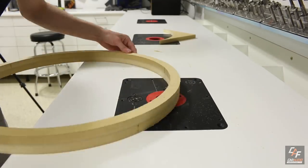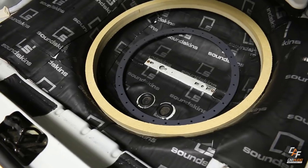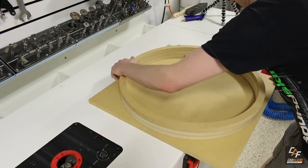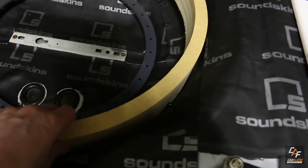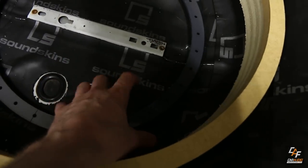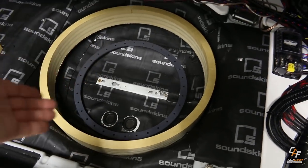After drilling a pilot hole to start the router bit I cut out the inside of the shape and then the outside. This gives an idea of what I've started to do in the trunk with the large circle — I definitely need to add a couple more layers. To add more layers I repeat the same process. I've now got four layers built of the overall circle size. Next I want to make the bottom layer that will space over and capture the smaller circle.